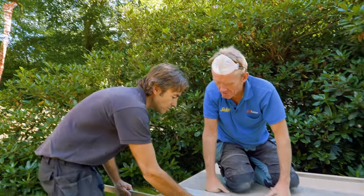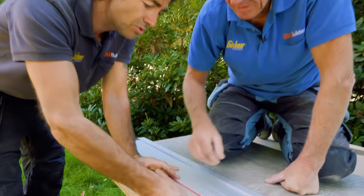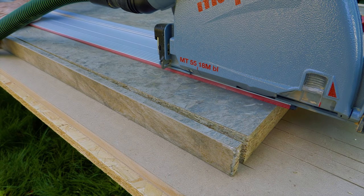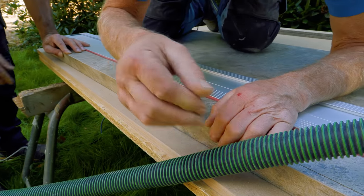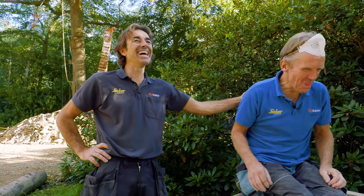Let's put these two cuts together and compare. Look at that — there's not a lot in it. Being that this is actually a rough side because it's got the splinter guard against it, it's still a great result. When I was at carpentry college, one of the things you never saw was glass paper or sandpaper — our lecturer said we don't use it, we use sharp tools and that's what we get our finish with.